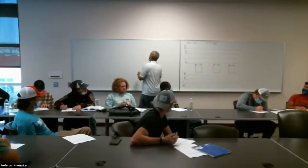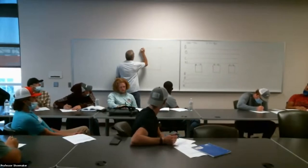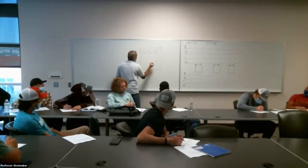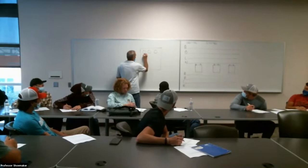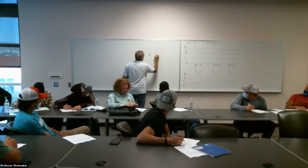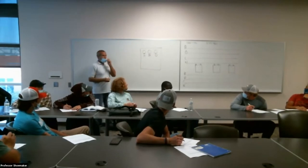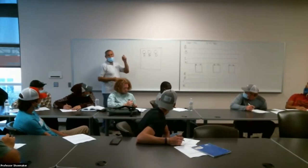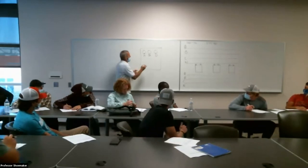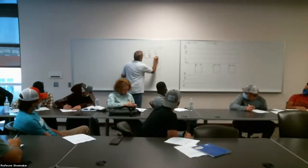You're tracking. So the normal transformer on the inside and the bushings inside, the leads that come from the coils of the transformer are A, B, C, and D. A, C, B, D. There you go. This is simple. How did you remember the AC part? AC electricity. Okay. So I need to take C, put it with A, and I need to take B and put it with D.